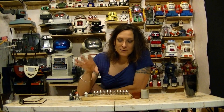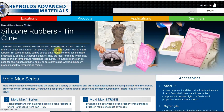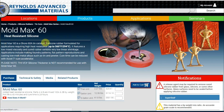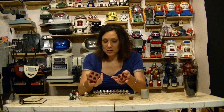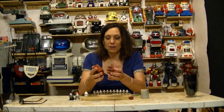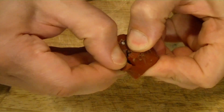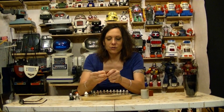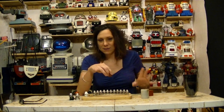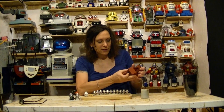If you go to the Reynolds Advanced Materials website, which is where I buy my supplies, you can see there is the Mold Max 60. The Mold Max 60 is made for pouring low-temp metals into it like pewter and tin. I've used this many times and it's still held up, so it is great for low-temp metals. There's a problem though — it does have a very low tear strength, so you can easily tear it even when new. It's a 60 so it's very dense.